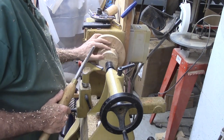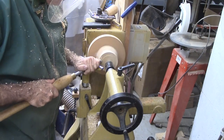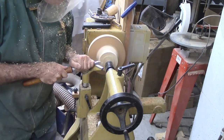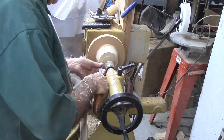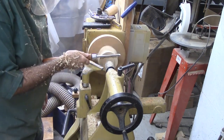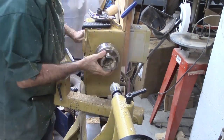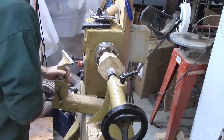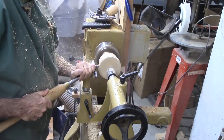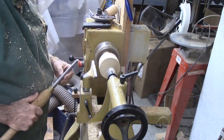I've seen a lot of experienced turners trying to cut perpendicular to the axis, but that is directly into alternating end grain for a tougher cut. Then clean off the end around the live center and cut a tenon. This will be a sacrificial tenon. With the wood now secure in the chuck, I can finish rounding it. Then measure for an expansion mount.